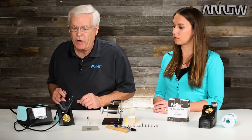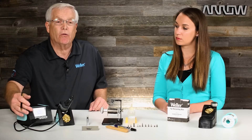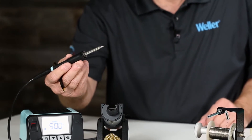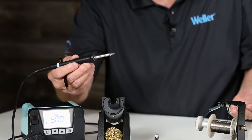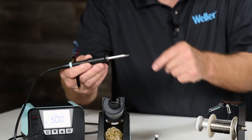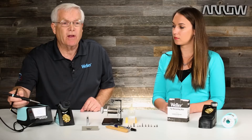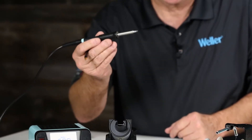The first thing I'm going to show you is when you tin your soldering tip brand new out of the box. The biggest enemy with a soldering tip is oxidation — tip oxidation. The first thing we do to get around that is when we tin a brand new soldering tip, we don't tin that at 800 degrees or 700 degrees. We lower the temperature down to about 500 degrees. It's not uncommon for a brand new soldering tip to be oxidized out of the bag. We try to clean these tips when they come out of the factory, but occasionally there'll be a little oxidation, perhaps a little moisture in the bag as you pull it out. You'll know that because you'll see the solder wire ball up on the end of the iron plating. There's a simple way to get around that — we're going to let the flux that's in the core of the wire do its job and remove that oxidation so that we get a good intermetallic bond on the brand new soldering tip.